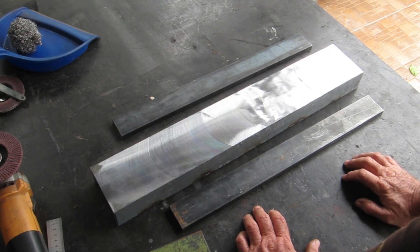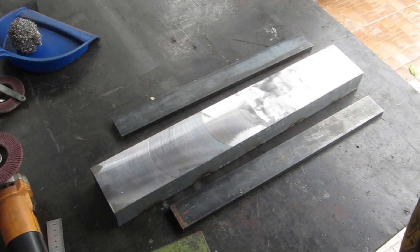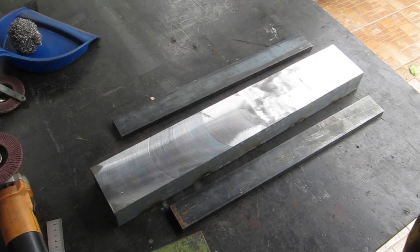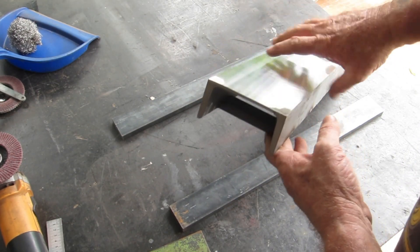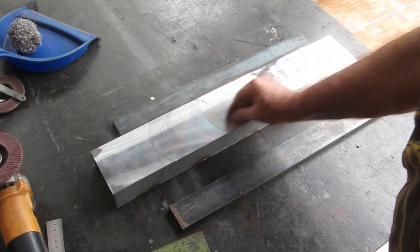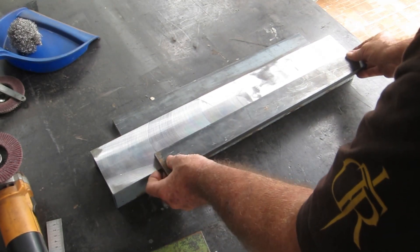As a result of that I've decided to order a plate this morning — it's just a little wider than that and 10mm thick. I'm going to plate 500mm of it. Part of the reason is you can see it's become a little thin just here, and I'm a little worried that once I cut a big slot down the center it's going to become a bit too weak, because these are going to get bolted down the sides.